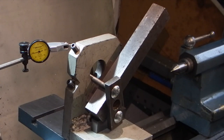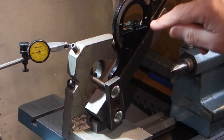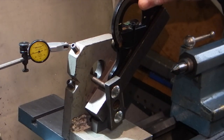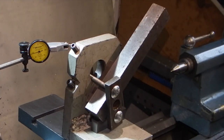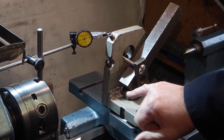To set this at the right angle I've used my protractor on there with a spirit level and moved it up to 45 degrees. So now I'm ready for the milling part. I'll hold the cutter in the chuck and move it across this bar to cut.